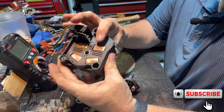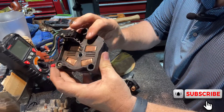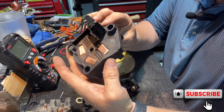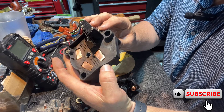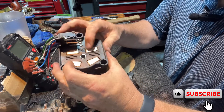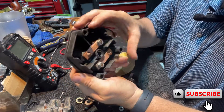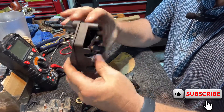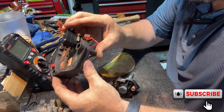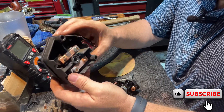I shaped a washer to sit underneath the contact — just put it on the grinder and shaped the washer to give the contact the height back that it needs. It's almost a little too high, but I'd rather it be too high than not high enough to get good contact. So I put that washer underneath this piece, put it back in the hole, tightened up the screws again, and it's pretty close to where it should be now — not countersunk. Then I cleaned up the bus bars that had obviously gotten hot.